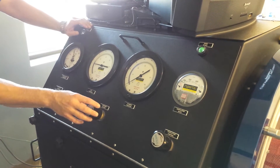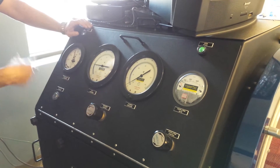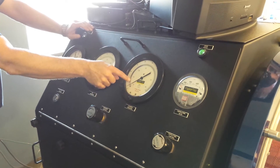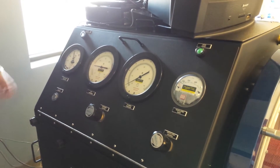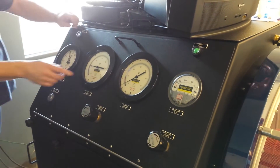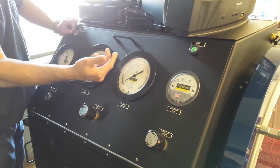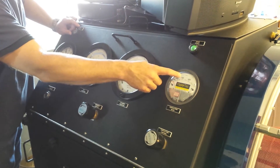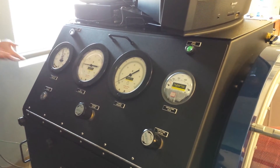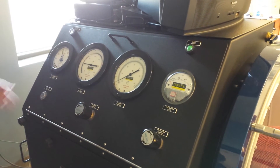So I take her to about right there. It's not going to go there immediately because there's a ventilation rate — meaning the exchange of oxygen so it's always fresh. This will start to move; this is the actual pressure inside the chamber. So will this go to 1.5 too? Yeah, eventually. You'll see it start to build. This here's your ventilation rate and I can control that too — it's the liters per minute of oxygen going in. It's constantly putting oxygen in and taking excess out so it stays at that pressure, so it's always somewhat fresh oxygen.